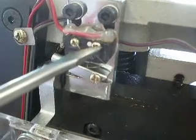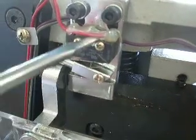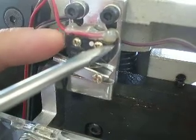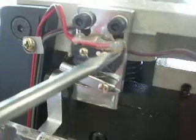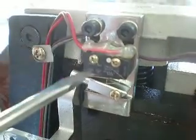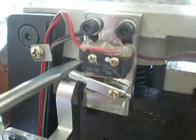So just first see if you can loosen those two and then slide this entire black little box up about a sixteenth of an inch, maybe an eighth at the most — but I'm thinking maybe just a sixteenth of an inch is all it's going to take. You may even just loosen one side and just lift up this one side only.